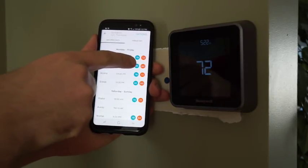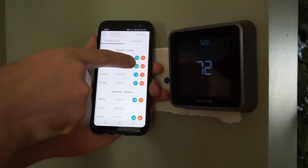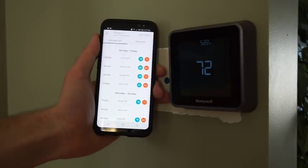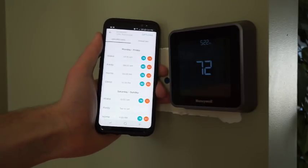When I'm at work, the house is down to 60 degrees and I live about 20 minutes from work. No matter what set point I use, I can get home in 20 minutes, but it takes my furnace something like an hour and a half when it's cold out to heat my house. But if you only have your day set point a few degrees cooler than your home set point, geofencing might work a lot better.